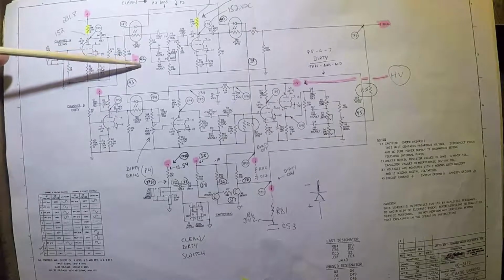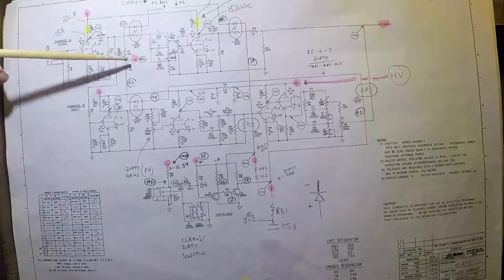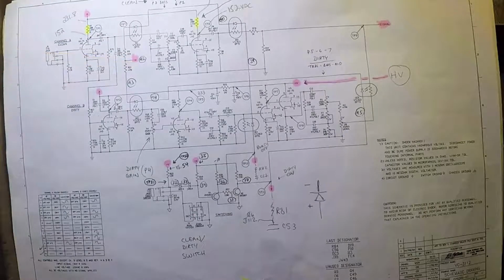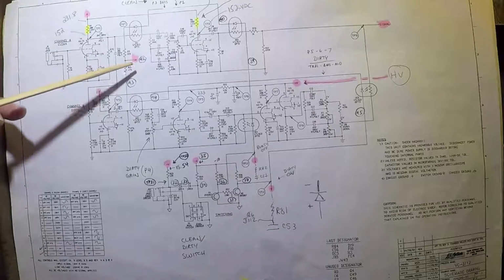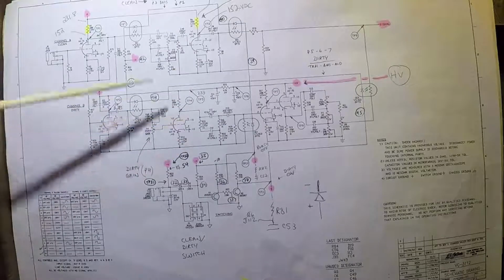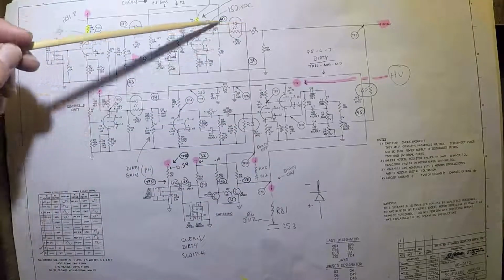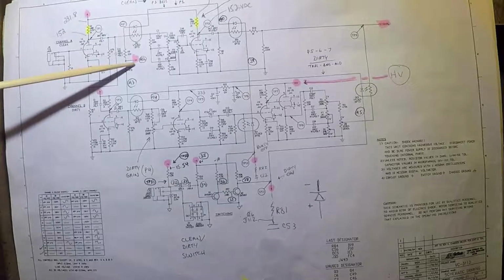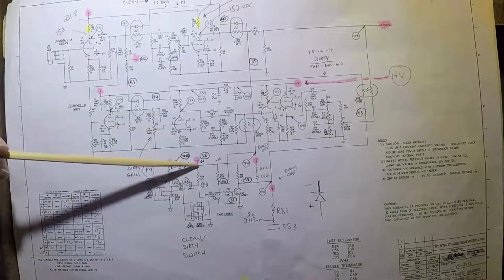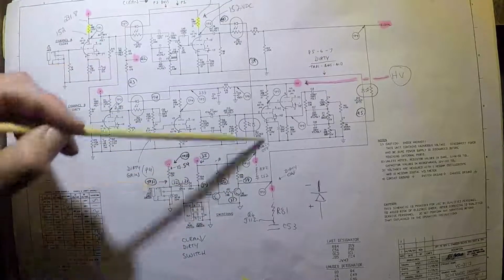And as you can see, I put a little notation here, 42. That's a test point that I created to make sure that in either case I was getting this -10 volts at this moment in the circuit, which I was. So that's essentially how this works. You've got this loop, comes up here, goes around here, comes back and goes over here, and then where it says -10, it comes back over here and dumps down and goes around again. It's just a basic loop.